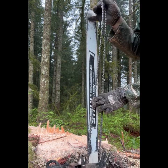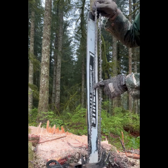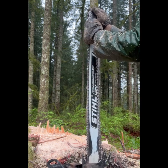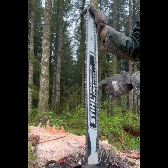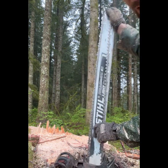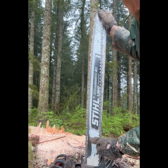You want your chain on the same side of the bar as your bar nuts. You'll start to feed your chain into the top of your bar. A lot of times when your chain comes off, one of the drivers will get birded. If you have a birded driver, it won't want to sit in your rails and it'll be raised up like that.